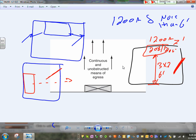and width is more than 6 feet, then you are required to have two doors coming to that room where your equipment is located, with one exception: if the door is directly in front of the equipment, unobstructed, continuous, or if you double the clearances in the front of the equipment. These are the two conditions where you do not need two doors. Any comments, any questions? When you guys become engineers and designers, that's what's required from you, the clearances in front of the equipment.